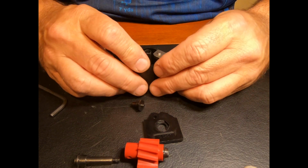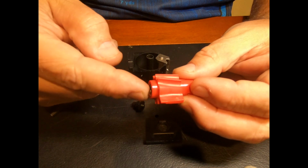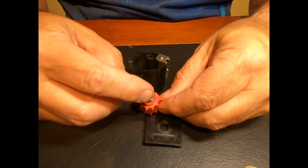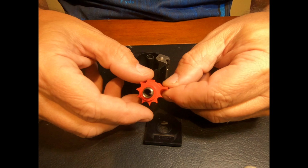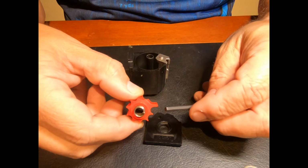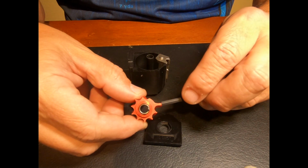Okay, so we're going to put our assist tool from Tandem Cross in position. We're going to take our rotor with the rotor ring spring intact and the little nubby of the rotor spring facing up and out towards you. I'm going to take this larger fin. If you notice, one of the fins is much larger than the others. That's because this one is going to hit the feed lips at the end.